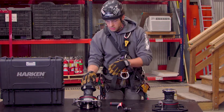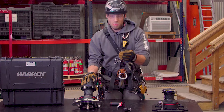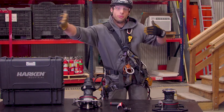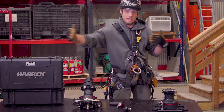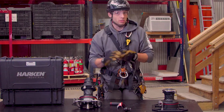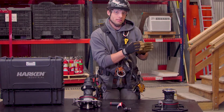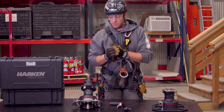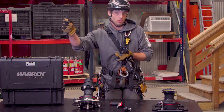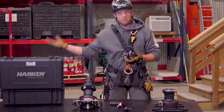We're looking at long-haul scenarios and confined space scenarios where you may not have the physical space to operate a full rescue team, or the full throw of rope that a mechanical advantage system needs to actually pull the load. For any mechanical advantage system — whether four to one or five to one — you're going to use that same multiplier in rope, meaning you'll need to advance four times the amount of rope to achieve the lift, which requires a lot of resets of the system, adding time to a rescue and obviously manpower.